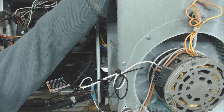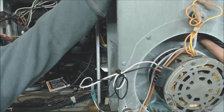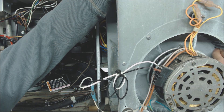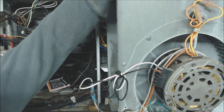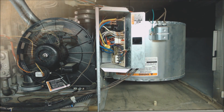Another problem could be that the blower motor bearings could be bad. Make sure the power's off, and then you can feel in here and see if it actually free spins, and also see if there's any rocking that occurs when you try to move it. That would indicate that the bearings are bad if it doesn't move, or that there is some rocking and binding up in there.